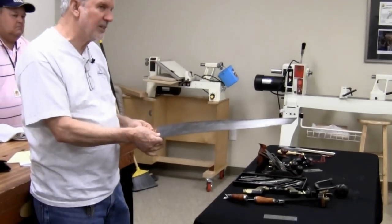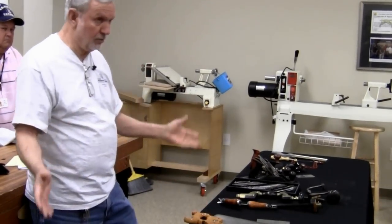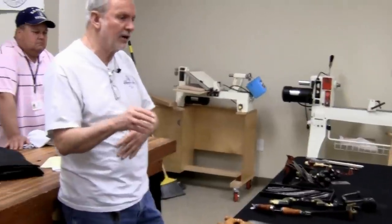And that furniture wax or something like that. It'll work. It won't last as long. It wears off real quick. Here's a good trick. You're cutting dovetails with your saw, and you know your saw starts to pull a little bit, wax it. It'll cut like hot butter after that. It won't last forever, but the Renaissance wax will last longer than any of the waxes I've tried.